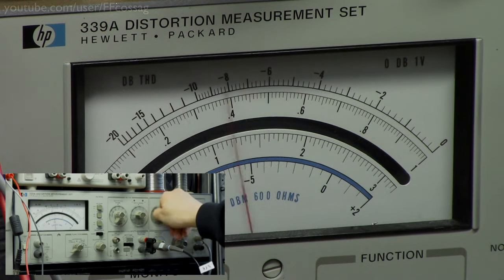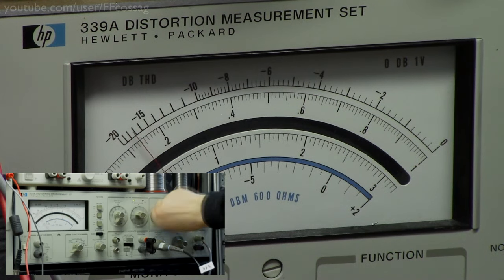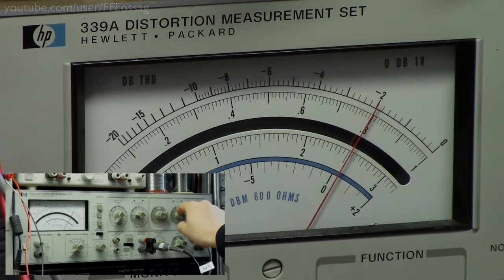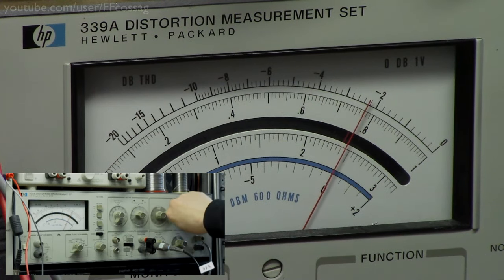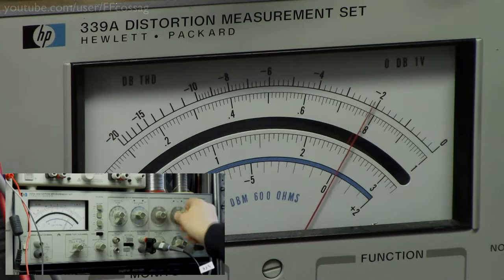So let's check the higher range where it starts to roll off in the high frequency. So 70 Hz, 80 Hz, 90 Hz, 100 Hz. Down 0.2 dB at 100 Hz. 110, 120, 140, down 1 dB at 140 Hz. So we're really getting up into quite high frequencies for a so-called subwoofer right now.